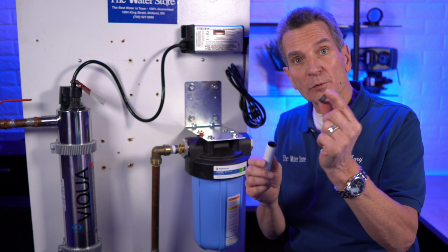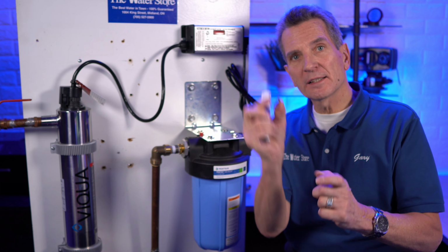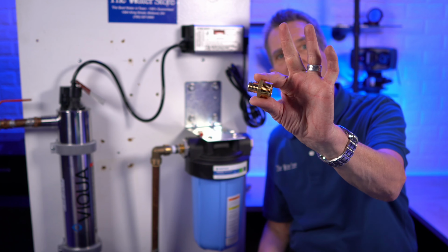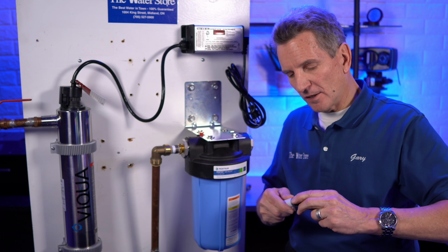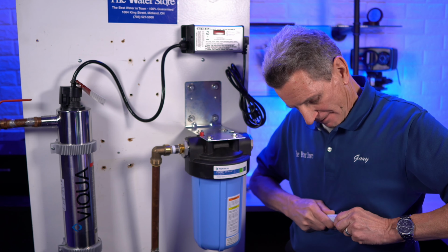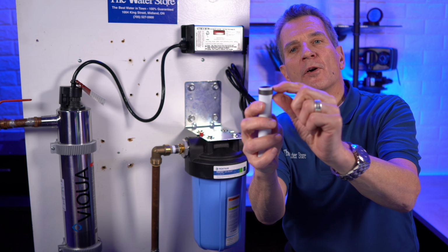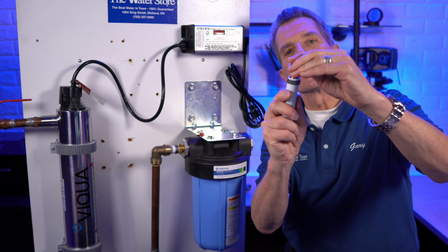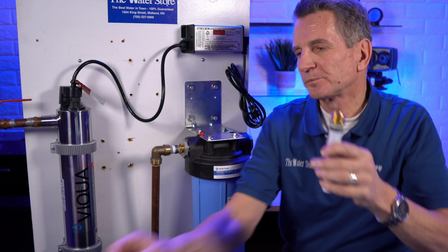So one of the easiest ways to work with is PEX pipe. So this is PEX pipe. It's plastic. It involves a collar, and it involves a fitting that looks something like this. So to use this, you just slide the collar, or slide the ring onto the end of the pipe. It should be about 1/8 of an inch from the end of the pipe, and then place the fitting inside. And again, you need to push it all the way down.